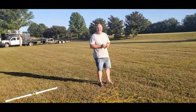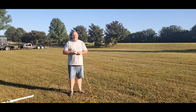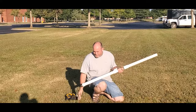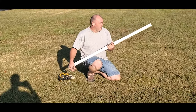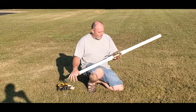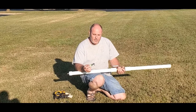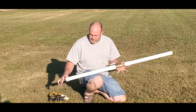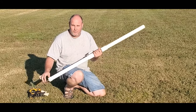That went a lot higher than I thought! That was pretty sweet — it went pretty high. We're going to walk over there and see where it landed. The 16 gram cartridge charged the air chamber up to about 110 PSI, and with that 110 PSI it deployed about 120 feet worth of rope. That's not how high it went but that's how far it went and how much rope it dragged out, which is pretty impressive. All in all I like it — I like the design, it was very simple to do. You can get these online and get them to the point where you can pay 50 cents a charge. There are a few changes I'm going to probably make to it.